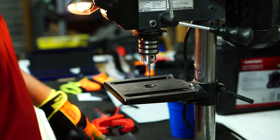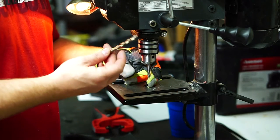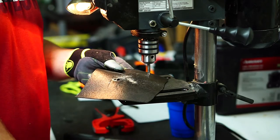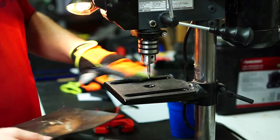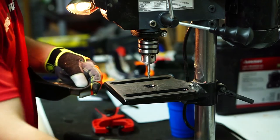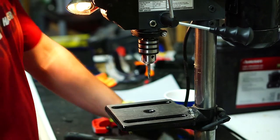Since the carbide bit has a rounded tip, it's not good at penetrating softer materials like the scale, so I'm switching back to a cobalt standard wood bit to do the rear hole. I've got a sticky mat material on my workstation to keep things from skidding, and I'm using recesses to align the pins with the drill bit so I'm not putting uneven pressure on the contoured knife handle.